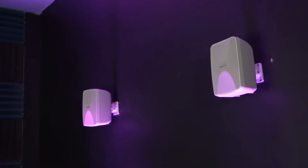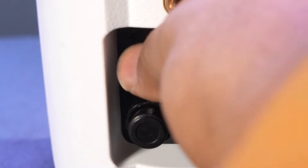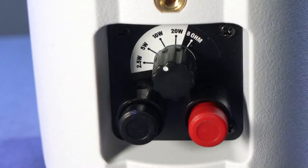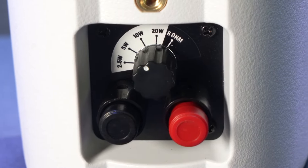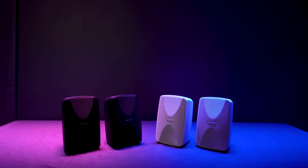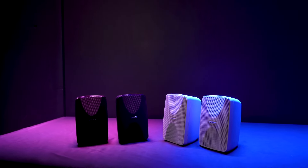It's very easy to tap these speakers. You just put your positive and negative speaker wires into the terminals, and then turn the tap to whatever watt amount you want. So let's say I wanted 10W, I would just set it to here. Wiring multiple 70V speakers to the amplifier and even to each other is very easy to do — it's all parallel wiring.